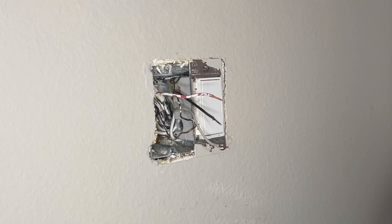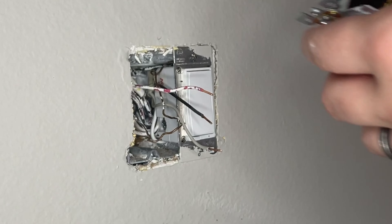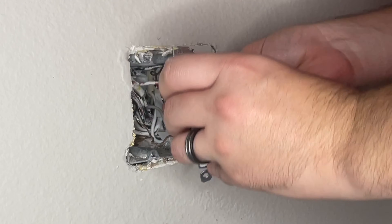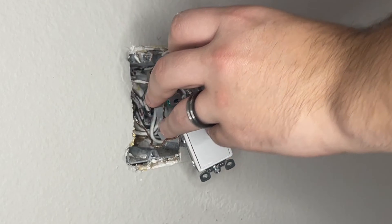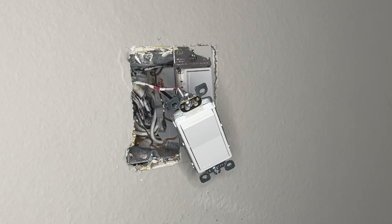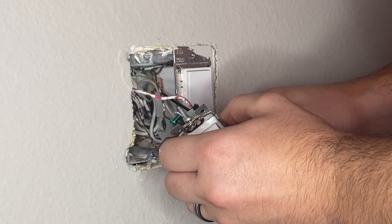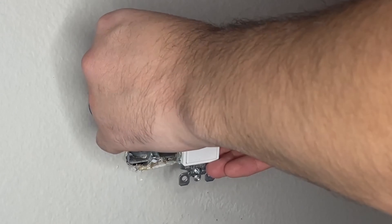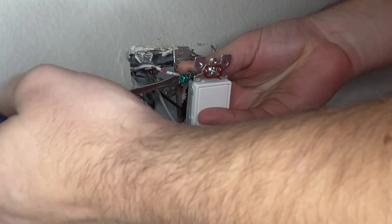After I had done some Google searches and had a good night's rest, I came back down to work on this project, making sure the breaker was still open so power was not coming into the switch and into these wires. I then removed my wire nuts. Something you're not going to see on camera is I did go ahead and take that neutral and solve that problem — making sure it was tied back in and not tied into the switch itself. Just make sure you're reading the instructions that come with your switch and looking things up online to make sure you're doing it right. You can see here I'm using the push-in connections and checking them to make sure they're in there good and tight.